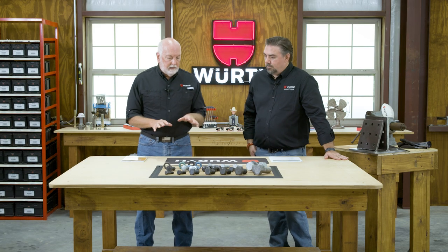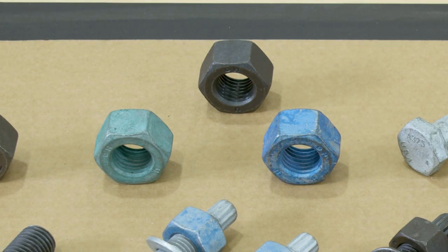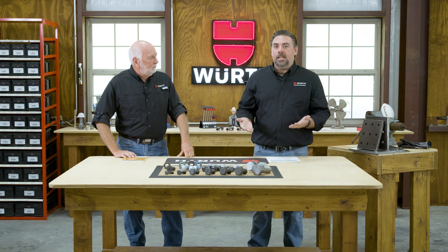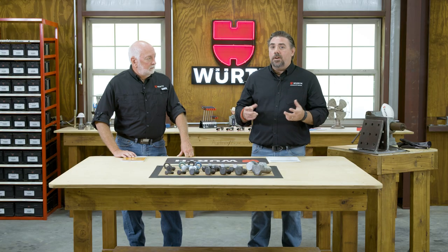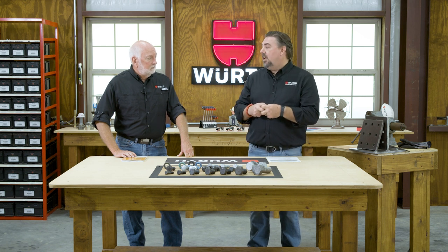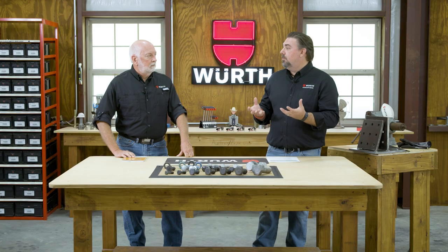Let's talk about the nuts. I see black, green, and blue nuts here. Despite being pretty, these come from one manufacturer, and the reason for the different colors is that manufacturer makes both a hot dip and mechanically galvanized nut, so you can differentiate those on site. Most importantly, whatever process your bolt has done, you have to match that to the nut — otherwise you won't get the thread engagement required, and you'll never reach the tensile strength you need. They add a wax coating that helps with lubricity and also identifies on site whether it's a hot dip or mechanically galvanized connection.